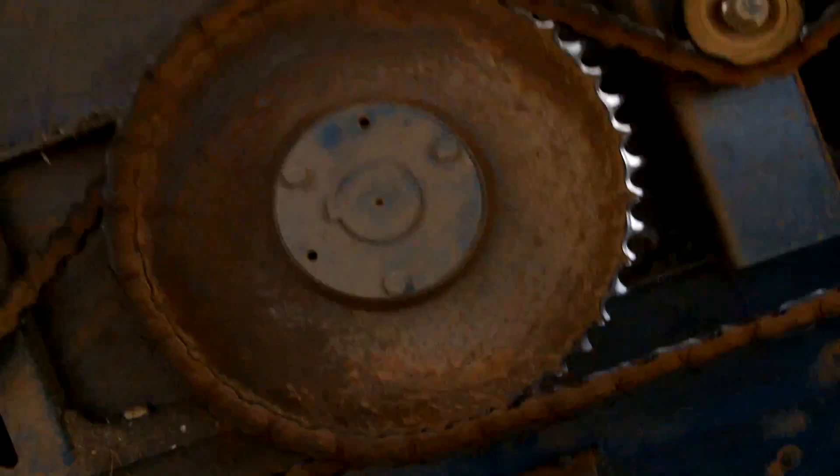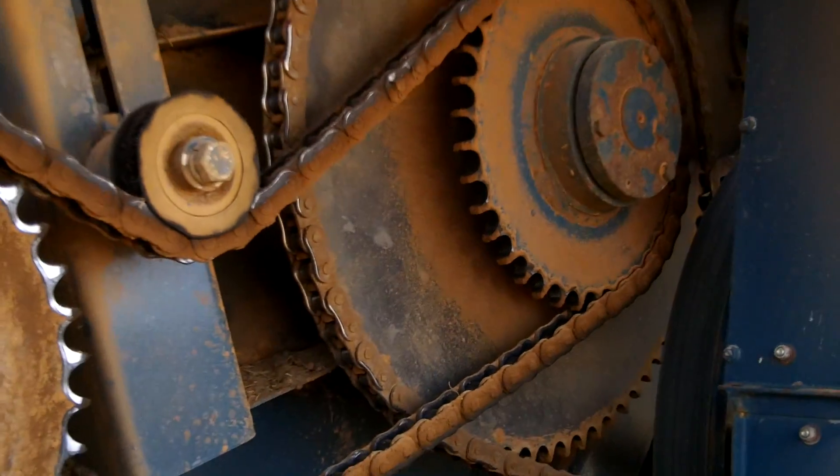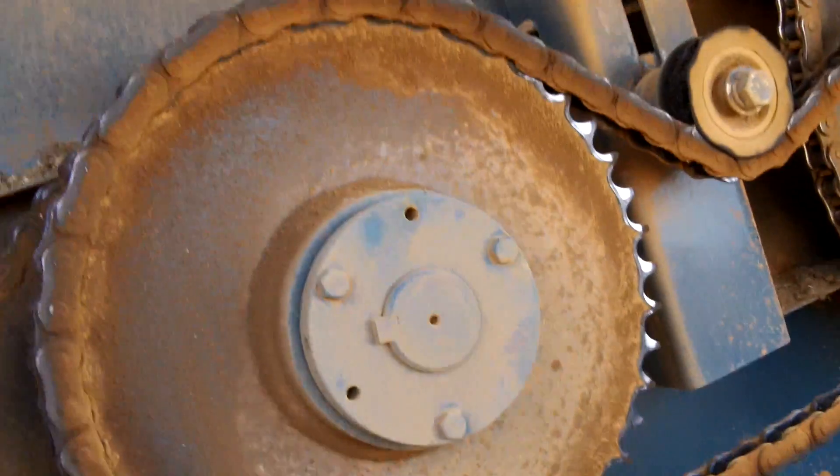And then they all collect — here's the bottom side view. There's one drum, there's another, there's another, and they all go at the same speed. There's a big round solid one, and there's a blower and an auger. It takes peanuts from the middle of the machine to the outside edge, and the blower forces it with air all the way up into the hopper. We'll run up here to the top and check it out.